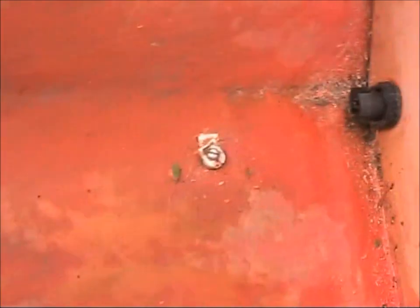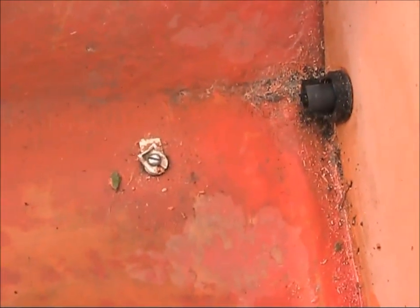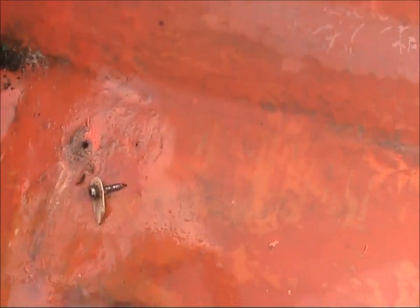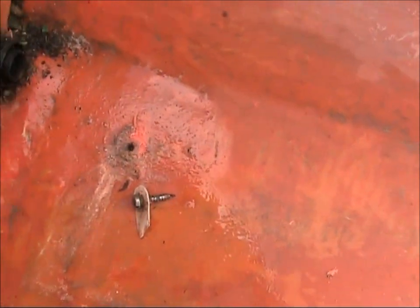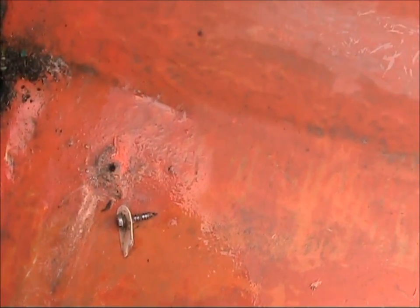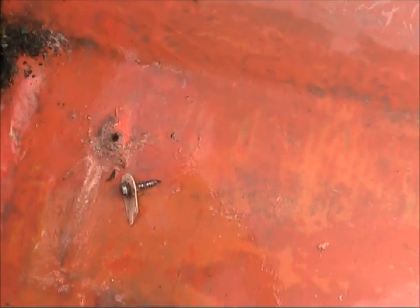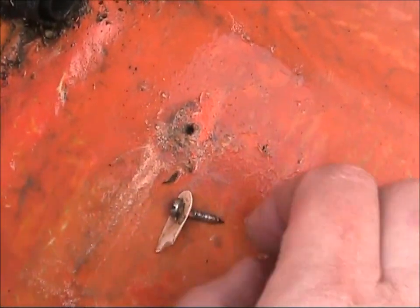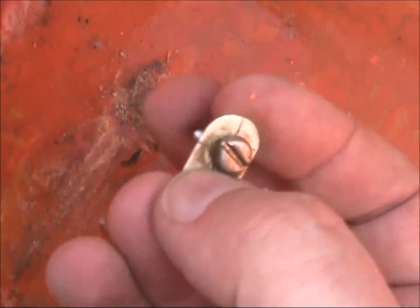Right, so I've just found another, well, I haven't just found them, I knew they were there, but now I'm actually in the boat and with a screwdriver in my hand I can take them out. It's just a couple of random screws stuck into the deck. So they're coming out. All these things unfortunately add up to why we've got a spongy deck, because you drill a hole like that into the plywood, which is all it is underneath there, and you've got straight away ingress of water, so that's what you expect really. One little tip though, when you do remove stuff like this, don't throw away the screws, because usually they're stainless steel, and these are the only screws that you can really use on boats, so they're always worth keeping. Obviously chuck that bit of random plastic away.